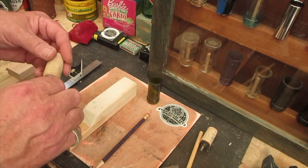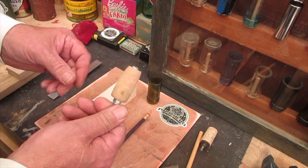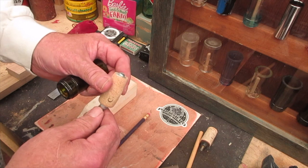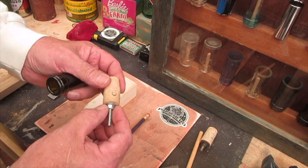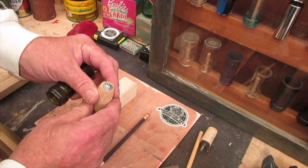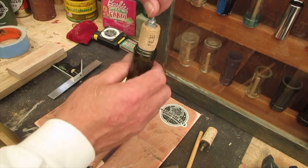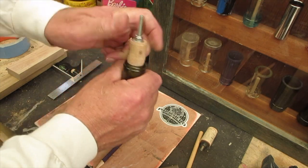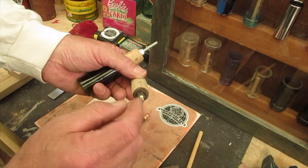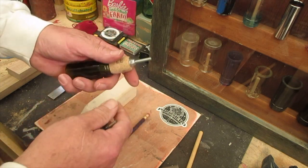The first thing I want to tell you about — I think you might have seen this before. You know what comes in every bottle of wine? Yeah, a cork or a screw top, so there's a ton of these laying around. We'll go back to the top of a bottle of wine — a cork. I've taken a couple of corks, taken a bolt, a nylon insert nut — I like those because they don't come loose — and a couple of washers. I've drilled a hole down the center of the cork so I can put the bolt in the cork and then put it in a drill press and it will spin. So it's just a cork with a bolt through it, a nylon nut with a couple of washers, and enough of the bolt sticking out to chuck up in a drill press. That's the first thing you need to do — really simple project.